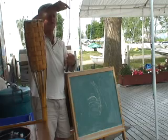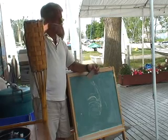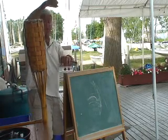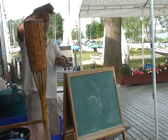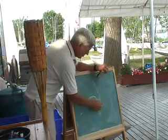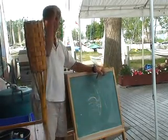The main gets flatter, but your jib stay is now going to get softer because the whole mast is bending and the whole thing is getting softer. Your jib stay is starting to get looser as well. All your rig is getting looser. So you've got to do whatever you can to get that mast back up to straight.